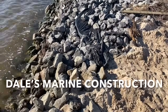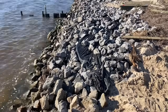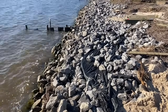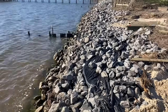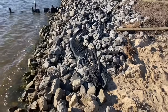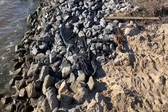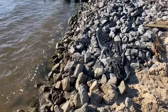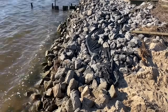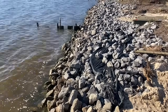More shots of the rock here before we get started. You can see how the rock is all laying down around the hurricanes — it washed the sand out from behind it because you can't really keep that cloth in place. The rock is a class 1, which was real easy for the hurricane surge to wash out all the sand behind it. So we'll come back with what I like to call a poor man's seawall on the backside — an economical way of maintaining the filter cloth in the upright position, and also giving your yard a good defined edge where it transfers to the rock.